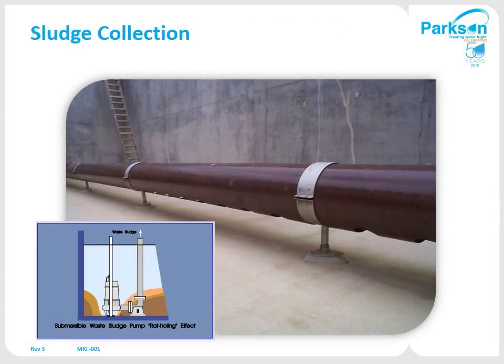The last phase is idle or waste sludge. We use a pipe with big open slots to pull from multiple points. You're maintaining a certain sludge blanket so that the mixed liquor concentration doesn't get so high that it gets sucked into your decanter, so you're always wasting some daily. These bugs are reproducing when they eat, so you've got to maintain your bug population and waste out daily. Competitors typically use a submersible waste sludge pump that will rat-hole and produce a very thin sludge to the digester.